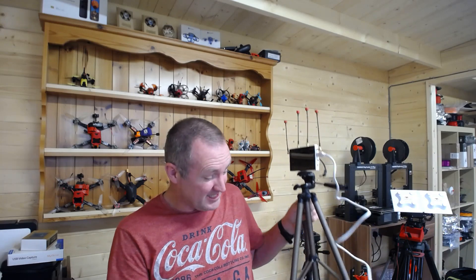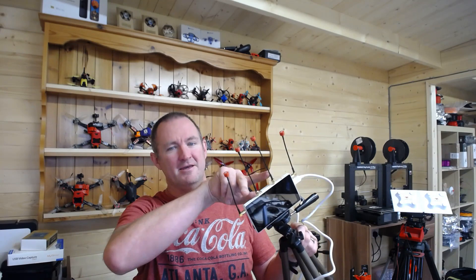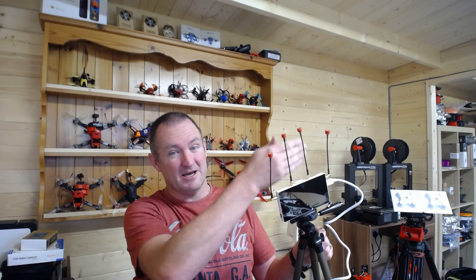Apart from that it's been plain sailing to set up. I'm a bit disappointed with the length of that cable — come on, Fat Shark, give me at least a three-meter cable. But I've ordered one, we'll get that sorted. The other thing I quite like is that the antennas appear to be structured as pairs — that's a pair and that's a pair — so you can put a high-gain antenna on each side and leave the two clovers. I'm going for two 13 dBi pepperboxes, which according to the manual should give me good directional coverage plus good all-around coverage off the top two.